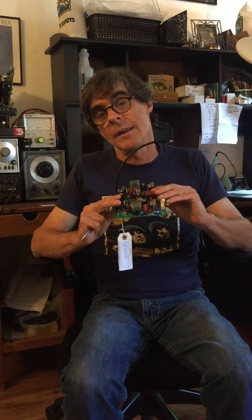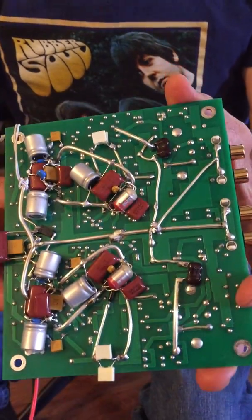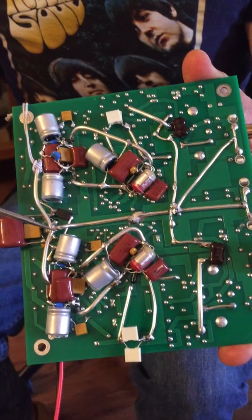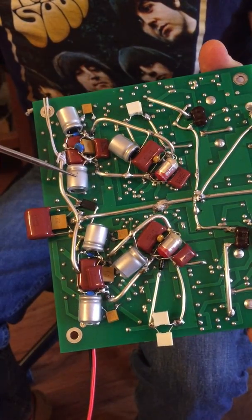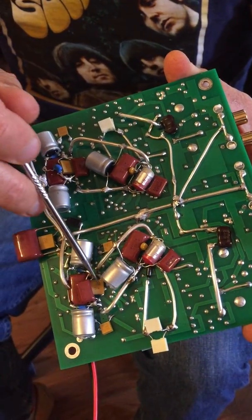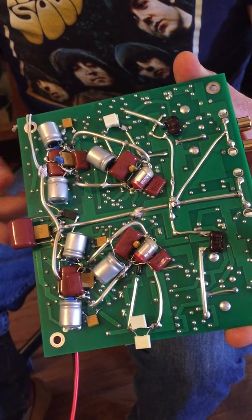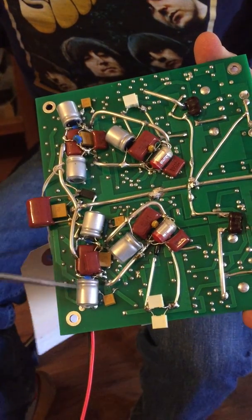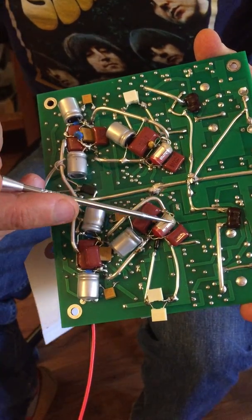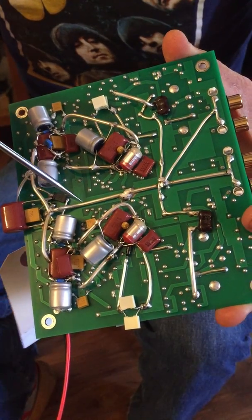That's the top of the board. Most of the work is on the bottom of the board, so I'll flip this over so you can see how busy this is. Most of what you see here — parts like these ones, all these parts — are not on the LCR Mark III. These little yellow parts also are not on the LCR Mark III. These are all capacitors relating to power supply — more filtering in the raw power supply area and in the regulated power supply area.